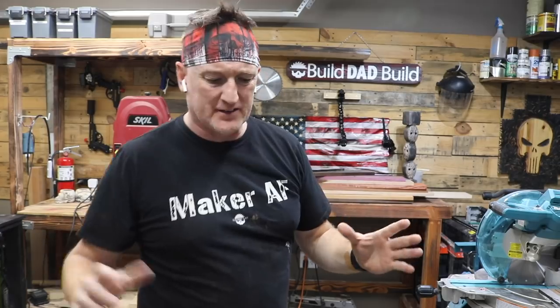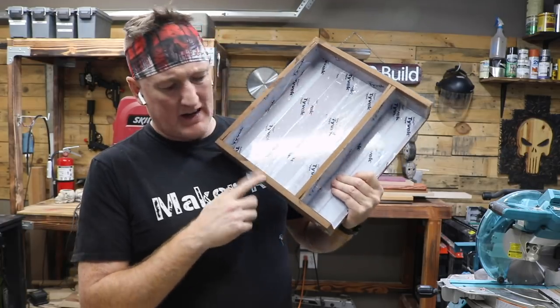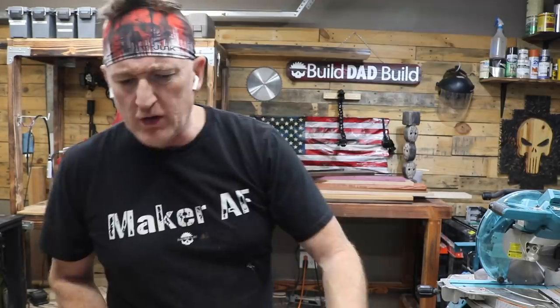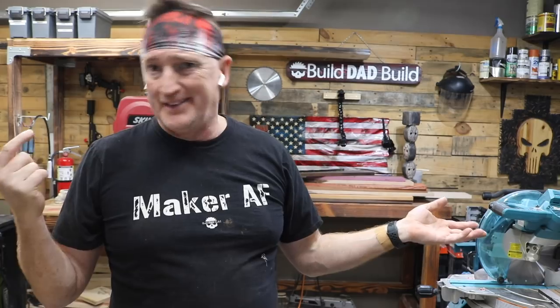I kind of cannibalized an old mold, and the reason I didn't show it is because I wouldn't suggest doing it this way. I got half-inch MDF and it splits really bad when you screw into it. So if you're going to make a mold with MDF, I would go three-quarters inch. Or if you can find melamine — everybody seems to be able to find melamine at the big box stores, I can never find it. I must be looking in the wrong place.